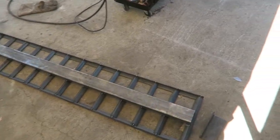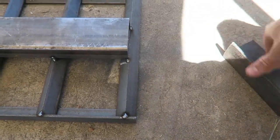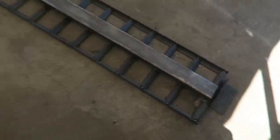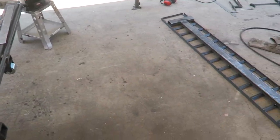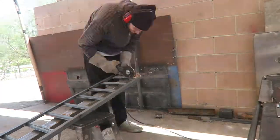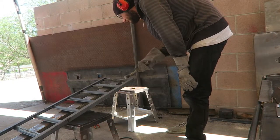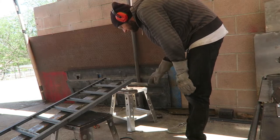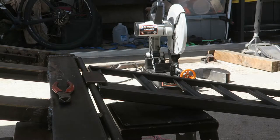It's almost all tacked together now. I still have to cut out a little bit — I got about 6 inches right here to add this piece, so I got to notch this area out, weld that on, and that'll be good. Then I also have to weld on that very last rung. I like to have it all leaned up because I do the last one at more of an angle so it's easier for the car to get up. I lined the ramp up where I think it should be, put that piece of angle iron right there, and it all seems pretty good, so I'm going to go ahead and throw a tack on it.